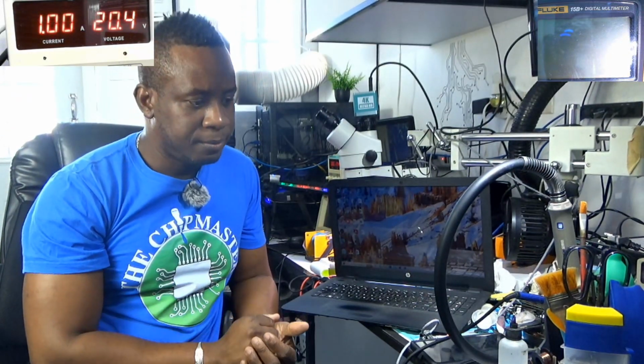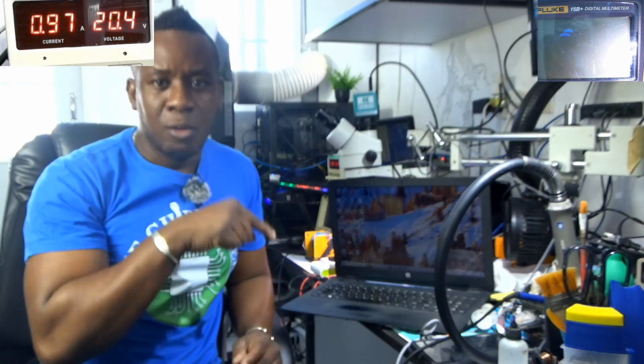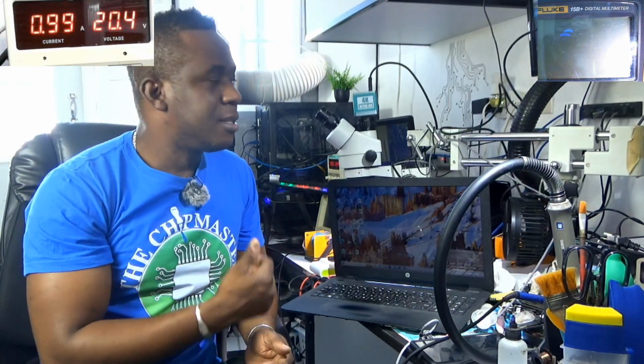Alright, so I hope you enjoyed the video. Alright, so I had a bad file there and it didn't work. So I had to get one from the HP website, decrypt it, reconstruct the BIOS using WinHex, and I created this one, which is from HP's official website, and it actually worked.